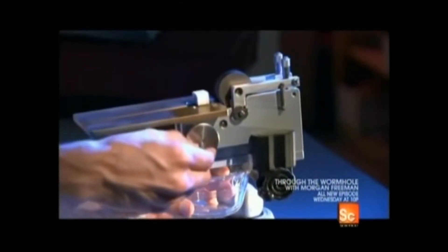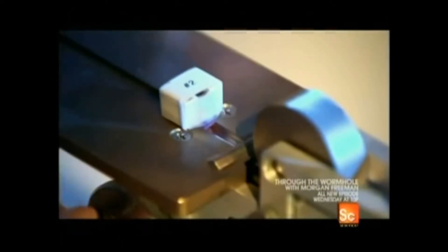If the weight checks out, the ribbons are carefully fed between two rotating gears in a crimping machine to gently crimp a corrugated pattern into the aluminum. Corrugating makes the ribbon stronger without adding any weight or thickness, and the grooves also affect the way the ribbon vibrates to create a richer tone.